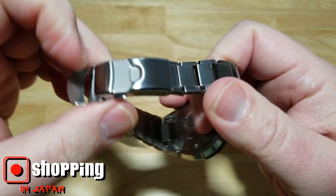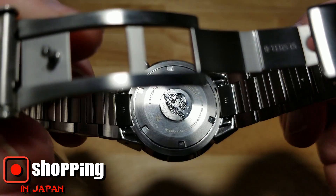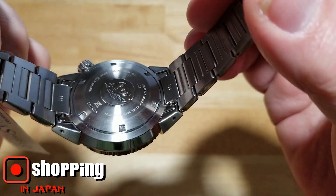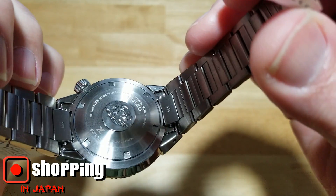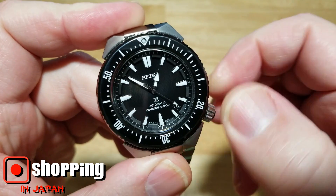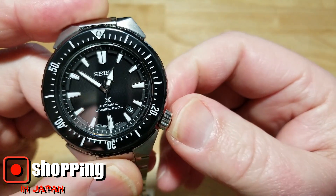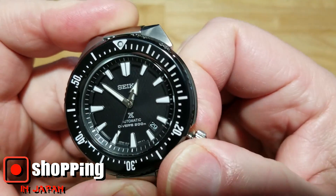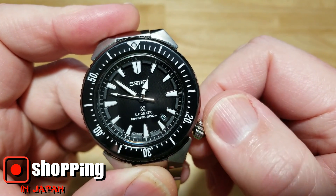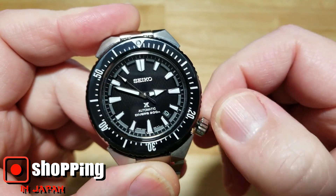Let's take a look at the case back. You've got your Seiko tsunami logo and basically what you'd expect: 'Seiko air divers 200 meter made in Japan, 6R15,' the Prospex logo, and the serial number. Neat looking case back — I like how it kind of tapers. Nice crown pop, super nice, buttery smooth winding — almost feels Swiss made, that's how good the winding is. The first position is your date — most dates on watches are counterclockwise. This has a quick-set date, so the moment the minute hand hits 12, the date instantly changes. The second position is your time setting, and of course it hacks — you can see the second hand stop right there.